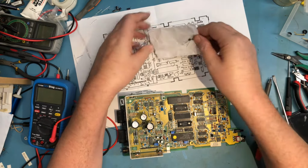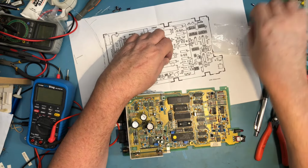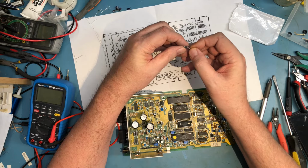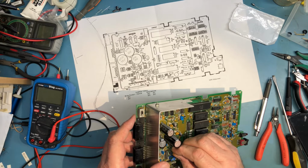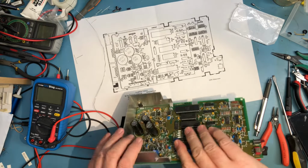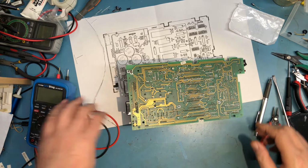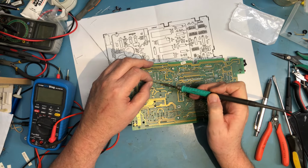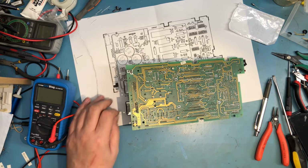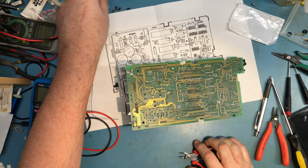I've got one up here that's a 2.2. That's 47. This then must be the 2.2, and my God, is it tiny. 2.2. Positive is up. Yeah, the replacement cap kit for the Atari 800 was beautiful. The lead spacing and everything matched, and it went very well. This kit isn't quite as nice, though. You can't say that the lead spacings on the original caps matched. They really didn't, on the board. Still can't complain. It's nice to have them all in one kit.